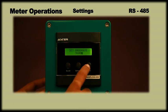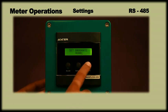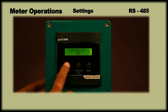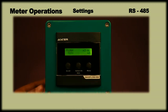The display will now show baud rate. Using the select CH key, we can choose the baud rate as 4800 or 9600 and press menu to enter. The display will now show device ID. Using scroll and select CH key, we can set the device ID. Press menu to save and exit. Please note, the maximum number of device addresses settable is 99.